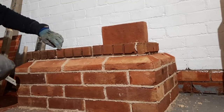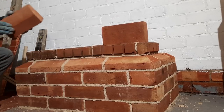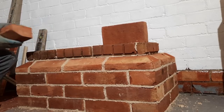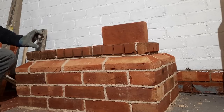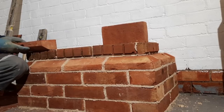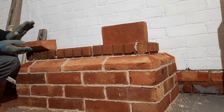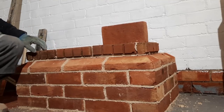Obviously on the back, because we're not going to be able to see them, we'll just run through with normal bricks on that. But then I think what we're going to do next is put these back on so we can have some plinths going through the top above them, and then we've got to step back, because we've got to get back to three bricks, which is what this is. Or we could simply start the twist on here, but I'd like to have a little bit of an oversight before the twist starts, so I am thinking that we'll put this back, simply because I like that feature as well, and then we'll do something a little bit different here, could be plinths again. We could put plinths back on here, just reduce it back down to this, and then we'll do the double twist.